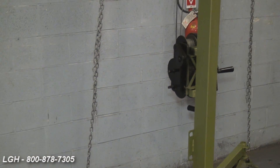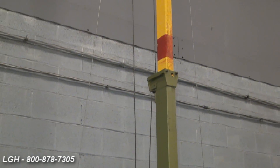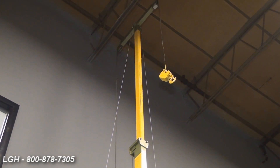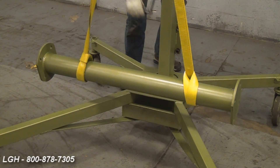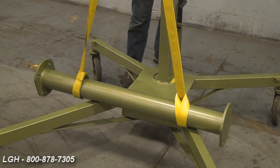I also want to remind you of a few safety guidelines. This hoist is intended for vertical lifting only. You should never two-block the hoist. When raising or lowering loads above 500 pounds, never do so solely with the mast itself. It's important to test balance the load before beginning lifting. And lastly, if you have to move a load, set the load on the base frame and move in a forward direction when possible.